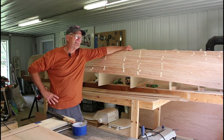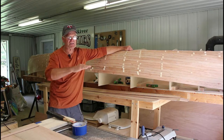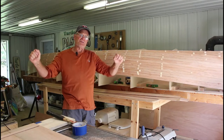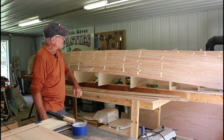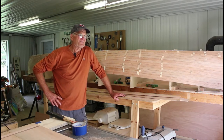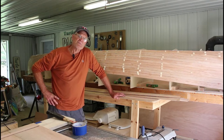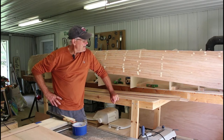Life's a learning process, so over the years I started thinking there has to be an easier way. A lot of the work involved ripping these quarter-inch planks, running each one through a planer, trying to get them all exactly uniform, and then trying to get an inch-and-a-half wide plank to bend in two directions to conform to the shape — made it not quite as easy or as light as it could be. So I started thinking: what if instead of 2x4s I used 4mm marine plywood — in this case Okume, which is very light but also very strong?